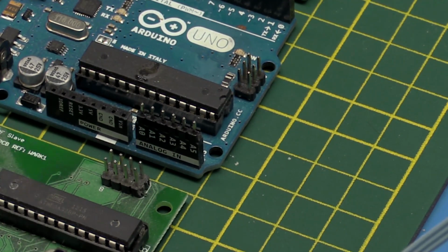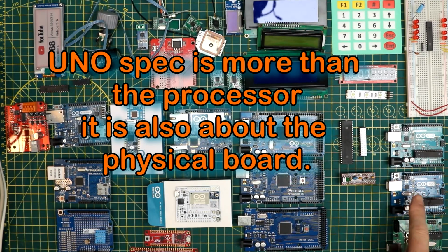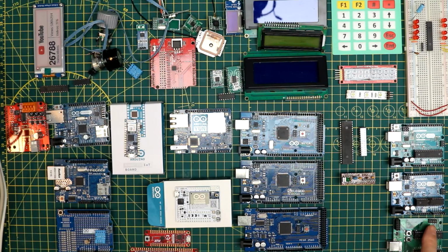And here is, let me go back out. Bottom, I have a custom-made Arduino Uno compatible kind of board. You can't program it through the USB connection. That's only there to provide power. You can see that it's not really Uno compatible, but it does use the same controller. So if you programmed one of the boards in one of these sockets, you could take it out, drop it in here, or you can program it via the ISP socket.